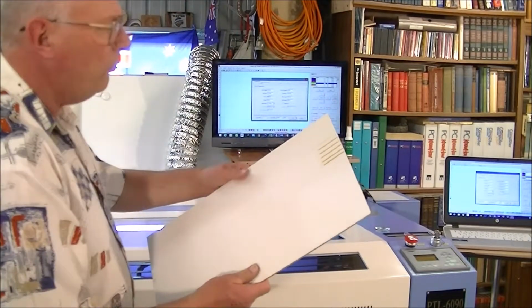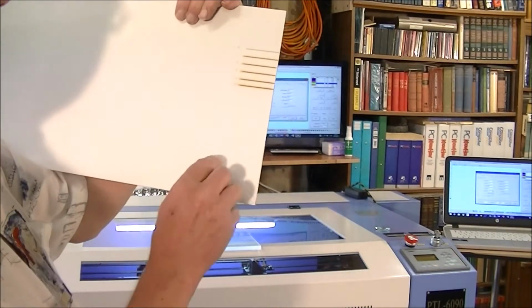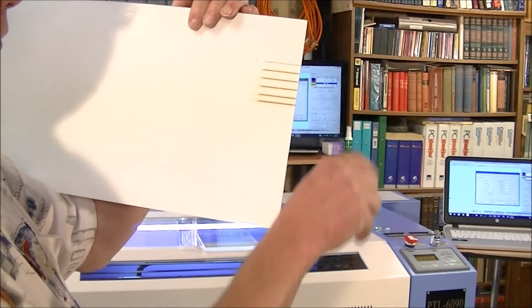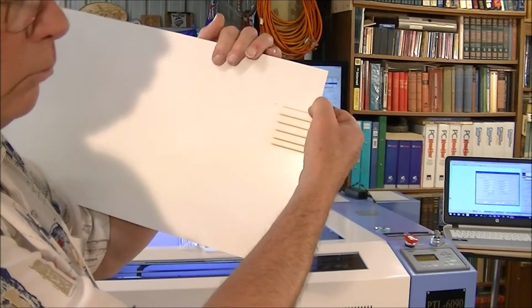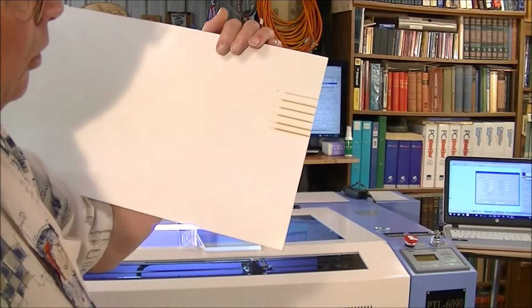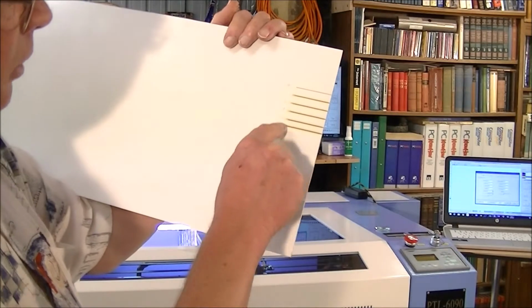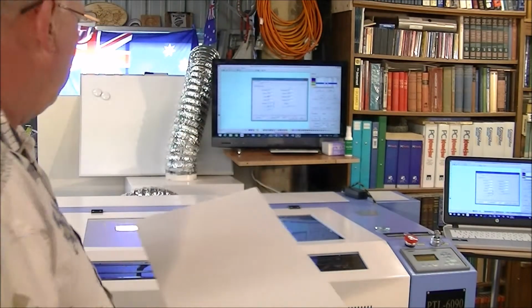Okay, that was the first cut, and you'll notice that the laser did not fire until 10%, so that is the minimum. It doesn't even fire, it won't fire at 9%, so 10% is the absolute first time that the laser will fire. So that's 10 to 15, and this is in the white material. And